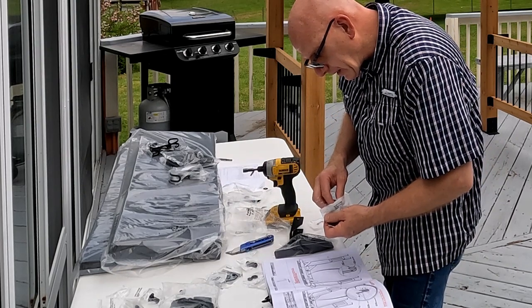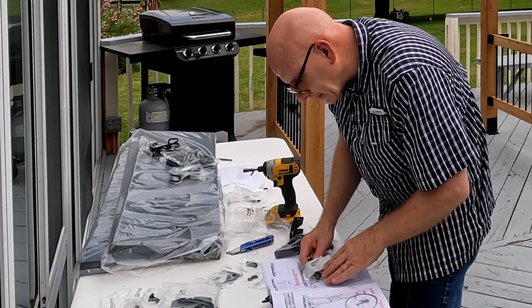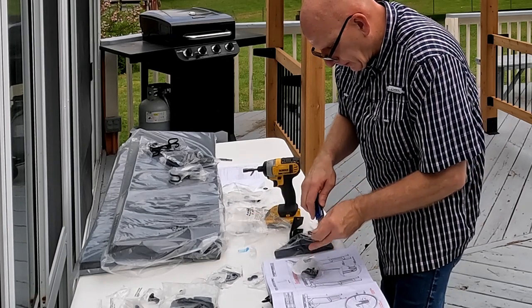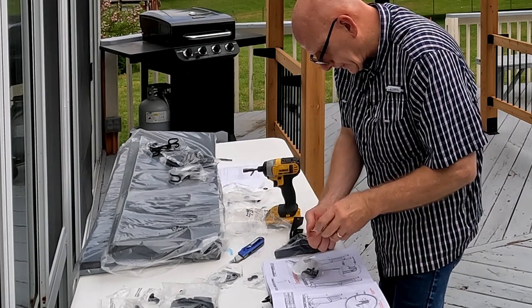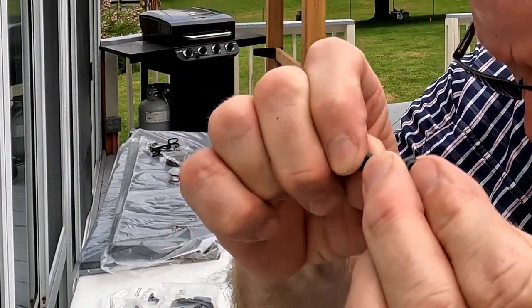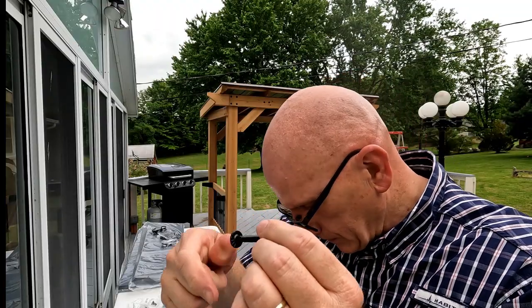Got washers, locking nuts. Screws, I don't have any of those. No, just locking nuts. New piece of hardware here. 1/4 inch locking nuts. Some people call them nylocks. Nylon locking, thread lock. It basically has nylon on the back side of the nut, so when you screw it on, you get so far, then you get into the nylon, you have to kind of cut threads into the nylon, and it keeps it from loosening without a tool.